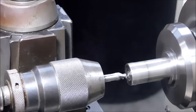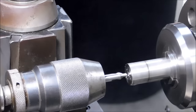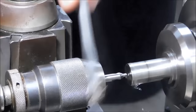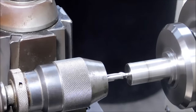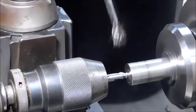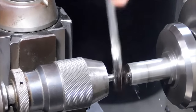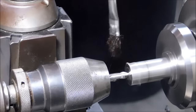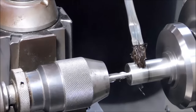When you know you have a deep hole, it's absolutely critical that you start tight. Start tight and end right. So let's spin the center drill around. I've shortened up on the spindle projection. I've locked it. I'm dragging the lock right now, and I'm feeding it incredibly slow. So the center drill is now acting like a boring bar. It's cutting the run out off, and it's cutting off the chatter on the bottom of the hole. And believe me, when you encounter this, you'll feel it, you'll hear it. There'll be all kinds of indications that it has happened.